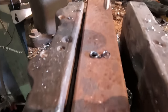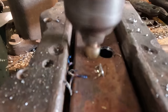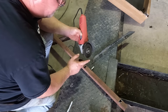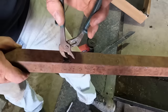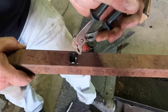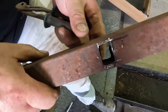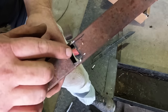Now we flip it over. I've got those two holes I made in the other side — we're going to enlarge those. I'm using the holes I drilled in the back side to make a box where I'm going to cut that out. I'm going to cut on those lines, but I can't cut all the way through because of the diameter of the blade, so I'm just going to score it. Even though this doesn't cut through, it's weakened enough that I can just start grabbing pieces and snapping them off with pliers. You end up taking out the chunk with reasonably square corners and the hole's not too bad. I'm going to weld around it, so this is fine. You can clean it up with a file if you need it better.